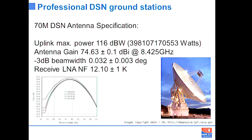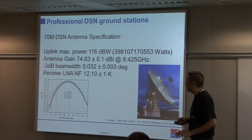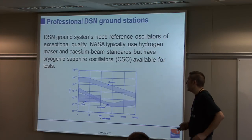The receive noise figure uses a cryogenically cooled low-noise amplifier with about 12 Kelvin of noise temperature — a little bit better than amateurs can attain, but you can still do quite a lot with not much equipment.